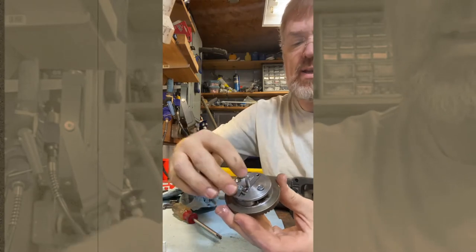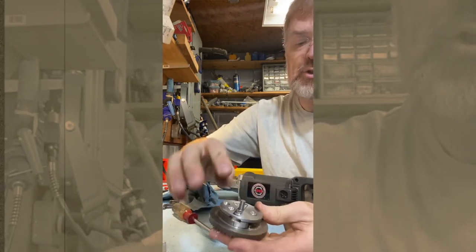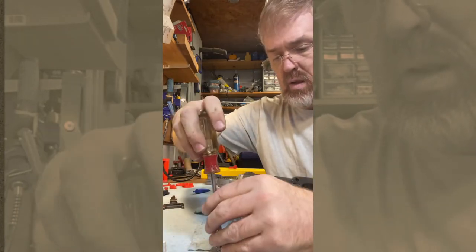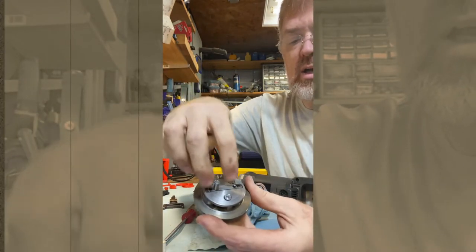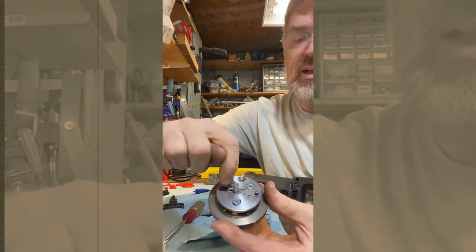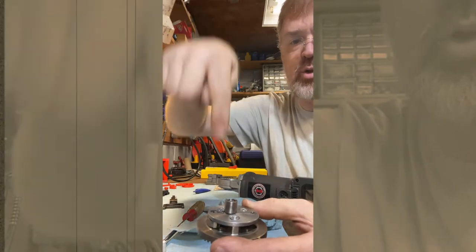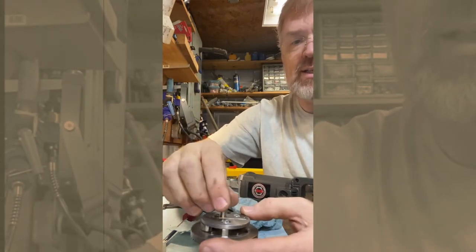The design here is that when these are tight, we want it tight enough that it's got a good secure grip but not so tight that this won't slide. My machining wasn't perfect because my mill has some runout and a lot of this was a struggle — I'm a beginning machinist and still learning. But I finally got it. There are two set screws on either end and those tighten up to keep it from moving. If I had to do this again, I would try to make the set screw a little bit farther away from the shaft, because when I put the gear on it blocks that set screw. So the only way to adjust this is to take the whole thing apart.